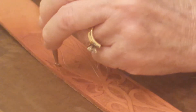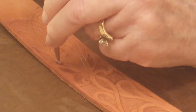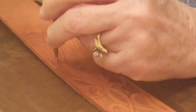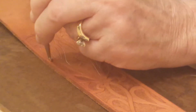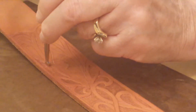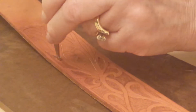I just sort of fill it in. Try to get it fairly even — an overall even look. There are lots of different techniques you can use for different patterns, but this is what I'm doing on this one. Get back into that corner again to make a nice sharp edge. Sometimes you want to tilt your tool a little bit to give a nice sharp edge on it, but normally you hold it fairly straight. It's got a rounded bottom — some of them have rounded bottoms so you can aim them one way or another, but generally you want to hold it straight.